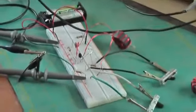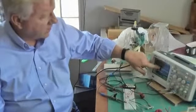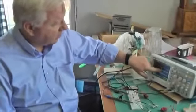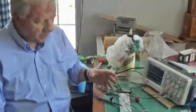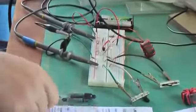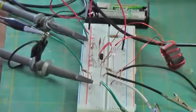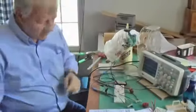You can see the variation in the power going in. Now, the power going out is being dumped across this output resistor here. This oscilloscope gives me a qualitative — semi-quantitative — view, because I can integrate under the power curve and that gives me the energy. Integrate with respect to time. I look at the output waveform and integrate that too. I've done a lot of that by hand, but I trust better a state-of-the-art oscilloscope, which I have available at the university. I go up there and it gives me the waveform, which I'll show you the results now.